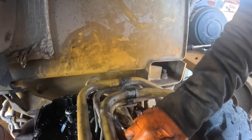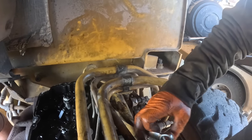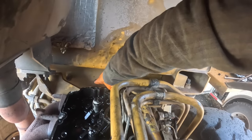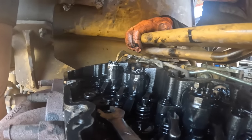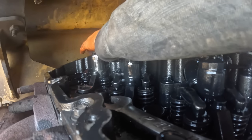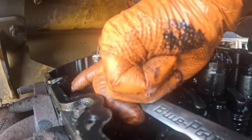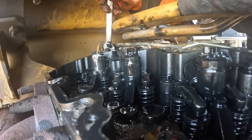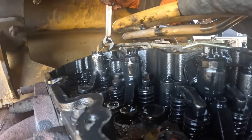We were rebuilding this thing — a really big rebuild. We're doing cam bearings, camshaft, new heads, rod pistons, liners, the whole nine yards. Air compressor, the fuel pump was sent off — the fuel shop said it was really bad shape. Pretty much everything on the engine is getting replaced except the crankshaft. There was a holdup on the liners because we ordered the kit and didn't realize the last guy that overhauled it had cut the block and put oversized press-fit liners in it instead of standard liners — what they call 20-40 liners. So we had to reorder the right liners.